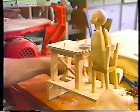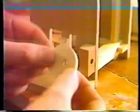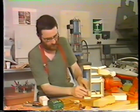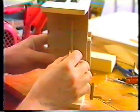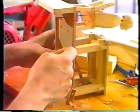Now we've got the cranking movement working to produce this spaghetti upwards surge, we're going to have to add the piece of machinery that makes the jaw work. I've bent that lever round at the bottom, so we're going to need a lever to waggle that, driven by a cam on here. We take this bit apart and add the cam — which isn't a circle and isn't an egg shape, it's just a shape with a bump on it. The best thing to do is put it in and see what happens. You need a lever to connect the bump on that to this part, and we can't really test it until that's glued and firm.